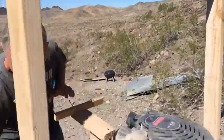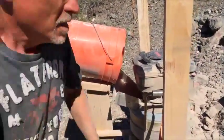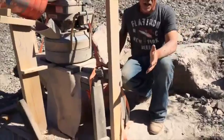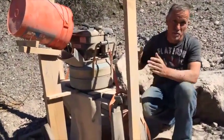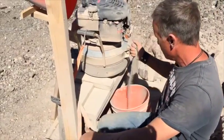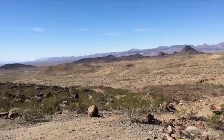We are running the crap out of this. It's got a Briggs & Stratton motor on it — totally bulletproof. Sure, it's got wear parts, but all rock crushers have wear parts. We do this so much we had to make some modifications: we've got a cool little brace that holds our bucket at the right angle so the rock will feed in. It's mounted on a frame so we can pull the bucket in and out with it running. We just slide a bucket underneath, let all the crushed rock fall in. You can do field repairs — little welds, little this and that. We're out in the middle of the desert, we don't have the option of running down and grabbing parts, but the field repairs work and the thing runs great.